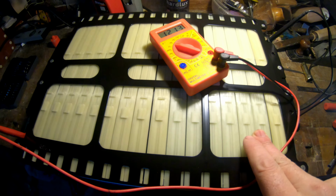Connection, have to do something with this, so let's see it now. It is 76.5 volts, so if we count the 6 that I separated, 1, 2, 3, 4, 5, 6, here is the voltage before charging, it is 45.8. These batteries are not charged, and over there you have seen almost 50 volts, so it's working very good.